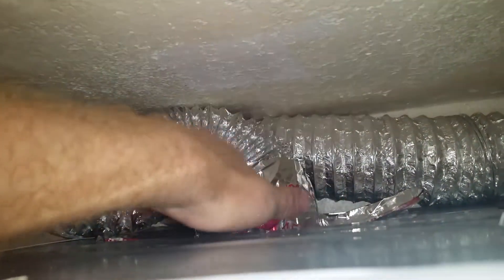It's not the prettiest job, but it is sealed and there's no air coming out — that's the important part. This is a high heat foil tape. It's better to use a rigid vent hose for this, but there's no room here. I'm still researching better options for this, but you'll have to check with your local code for what's allowed.